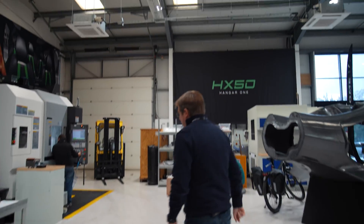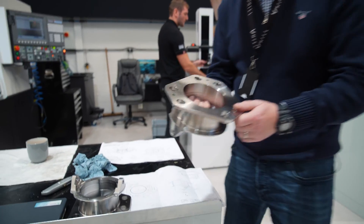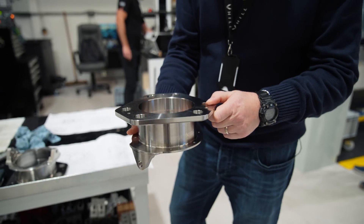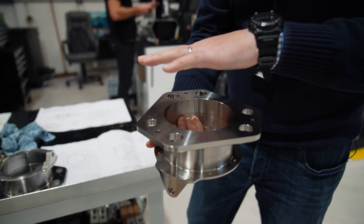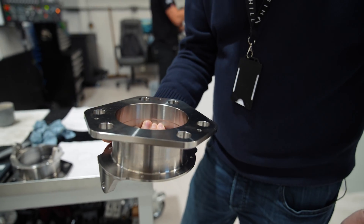Neil's been really busy over here producing the lower half of the mount. This sits on top of the rotor mast. Your strap packs pick up on each of these holes. And then you've got an upper part that sandwiches the strap pack, so this is what gets the torque into the strap packs and the blade cuffs.